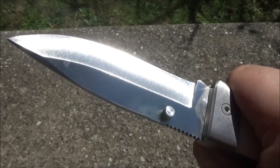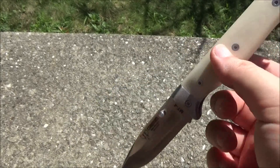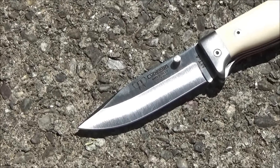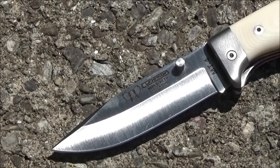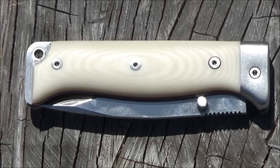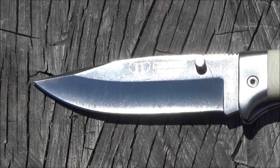Let's talk about that steel — N695, the equivalent of 440C. Don't let that scare you; good 440C is really a good steel. It's only when the heat treatment is poor, or some companies say 440 when it's actually 440A, or it has a bad heat treatment. Don't let those instances poison your mind about real 440C with a real heat treatment. There is good reason for using a highly corrosion resistant steel given the mission of this knife. As a camp knife, you're going to be preparing food — cutting fruits, vegetables, and meat — there's a lot of moisture. If it's raining or high humidity, you want something that will resist rust.